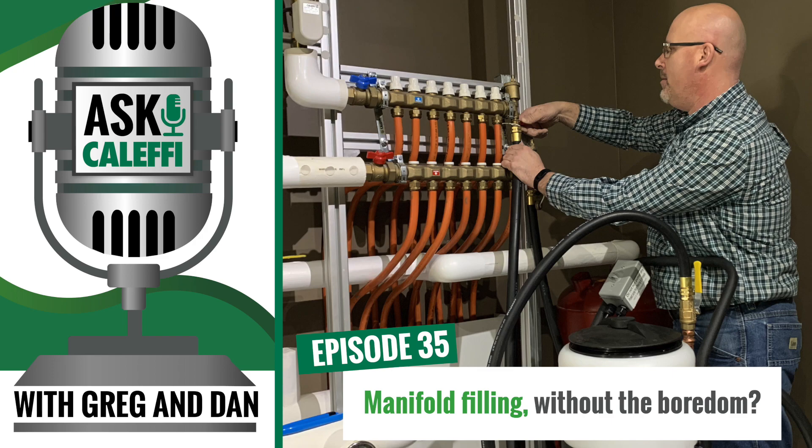My favorite way is to use those isolation ball valves on the inlet and outlet side of the manifolds — close them off. Then hook a garden hose right to the return manifold on the bottom purge valve. You can hook it to a fill and flush cart with demineralized water, or use another water source like a washer hose at a slop sink with a garden hose connection, or even a hose bib. Bring water in on the supply side, isolate all loops except one, and open them up one at a time — running it until you see nothing but pure water coming out and you're done getting burps of air. Close that off and move to the next one, repeating until it's completely purged.